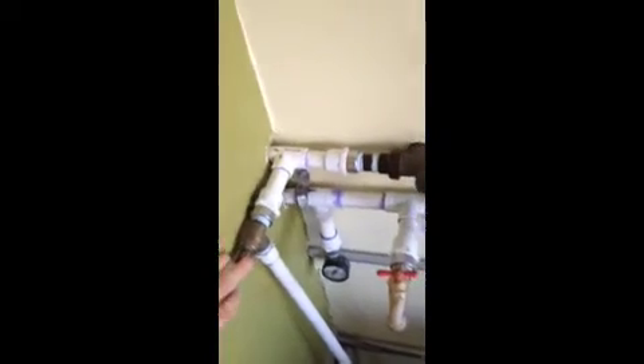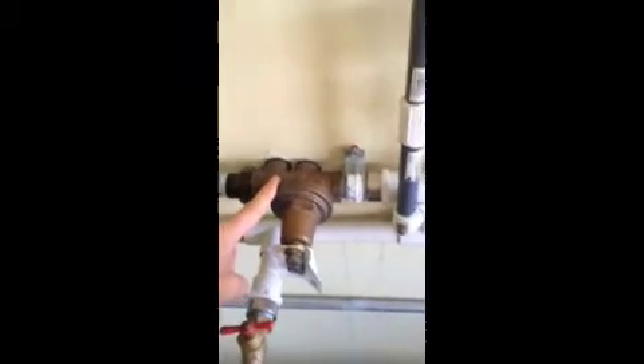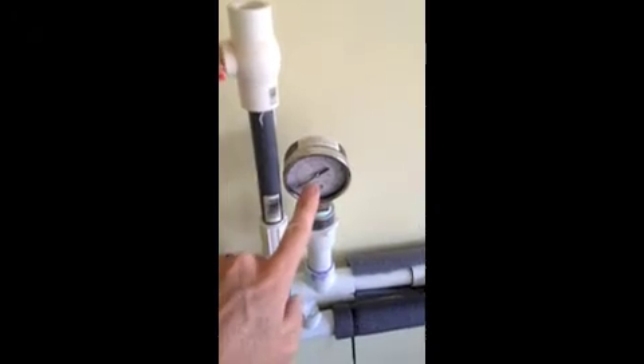I'm going to step on top of these fermenters to get a better look. So when it first comes out, there's a blow-off valve, which is actually not necessary. What is necessary is that you go to a pressure reducer, because jackets on fermenters can't stand over 15 PSI of pressure. So you need a pressure reducer and then a pressure gauge. There's also a bleed valve, but that's not necessary either. I like to set the pressure at about 13 PSI to start.